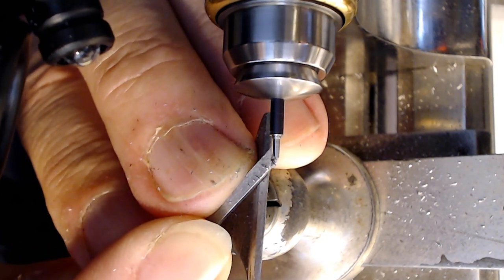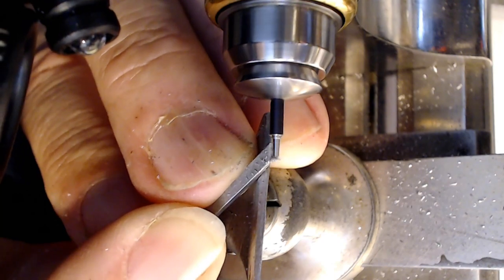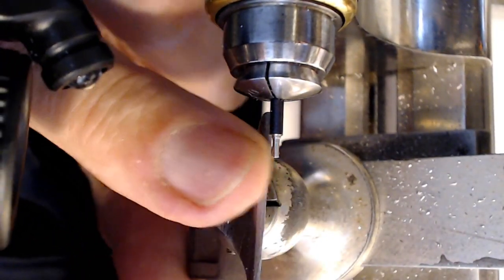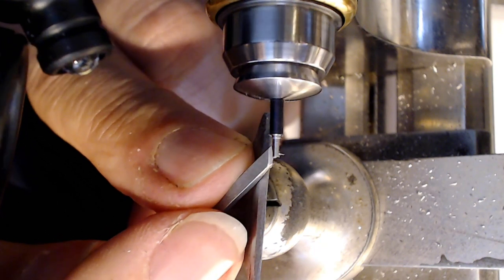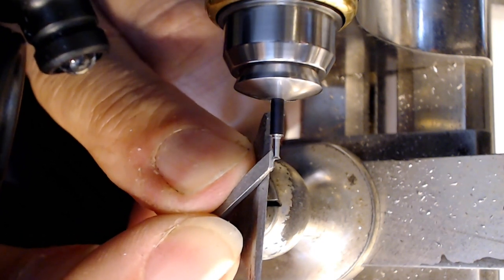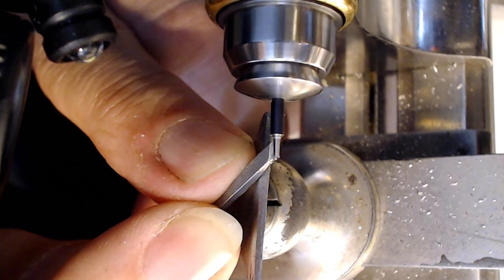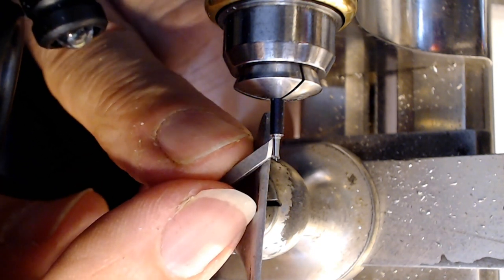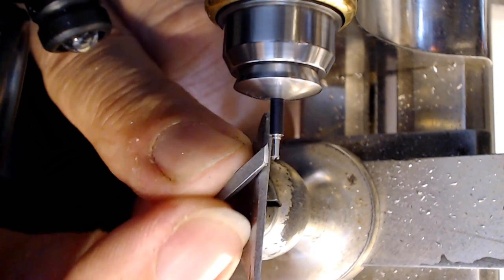And I got a lot of material to take away here. The hairspring will fit on, but I think the end is too long, so I may have to file or get rid of some of the end of that with a file or something, because that's way too long. I can probably use a very fine file and just rub it to get rid of that. So I will look at this and see if that's an 8, as it was in the other. And when I go to the edge here, I just want to go up to that rim that's the edge that starts the balance, and just make sure there's a defined edge. There it is there.